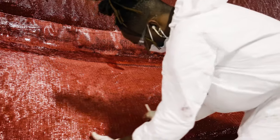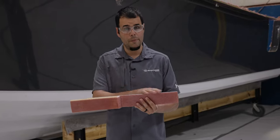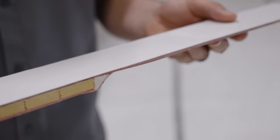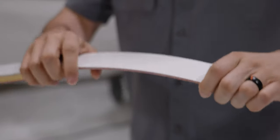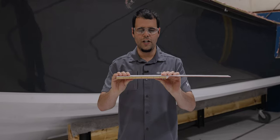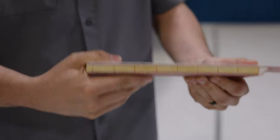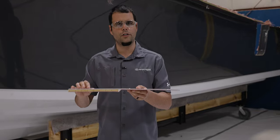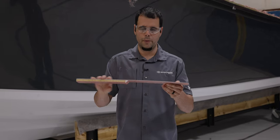We've devised a quick demonstration of what coring does to fiberglass. We have the same amount of fiberglass throughout this entire piece — the only difference is that on one side we've laminated a piece of coring. On the uncored side, over a long span you can see how much it bends under simple force. On the cored side, it's very, very strong and cannot be bent. The thicknesses of this demonstration have no correlation to our actual hull size; it is simply to demonstrate the strength of coring versus plain fiberglass.